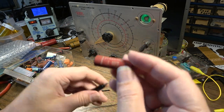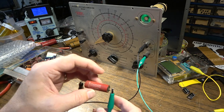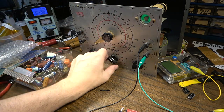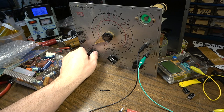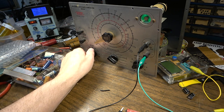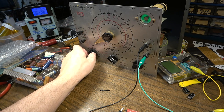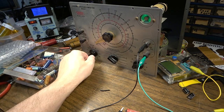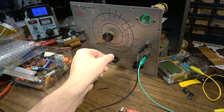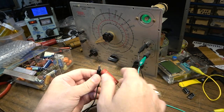Here's a standard capacitor — the type you find in a lot of old Dan Electros, some organs, a lot of different equipment. Let's try a leakage test. It's a 600-volt capacitor. It wouldn't surprise me if this one is pretty good because it's sealed on both ends — usually when they're nicely sealed, moisture doesn't get to them and they don't deteriorate. And that's exactly what's happened here: no moisture, no deterioration. Let's go measure the value — dead on. That's a good capacitor, probably from the 1950s.